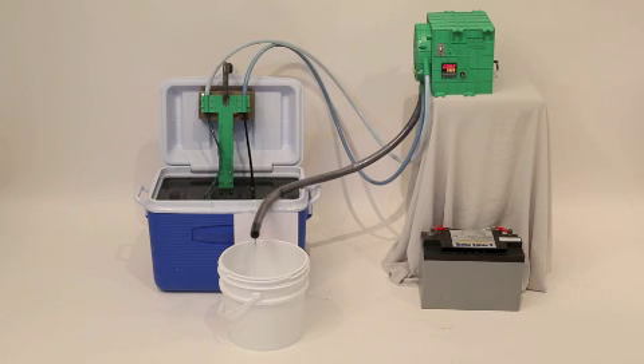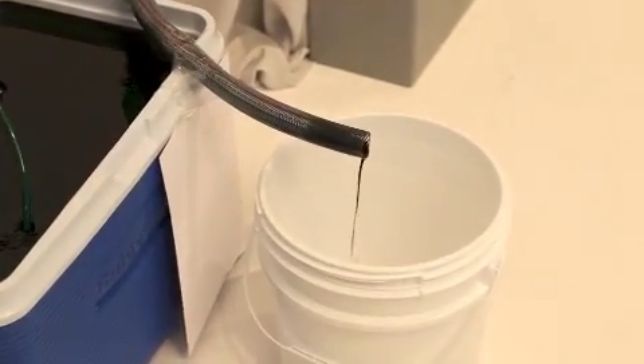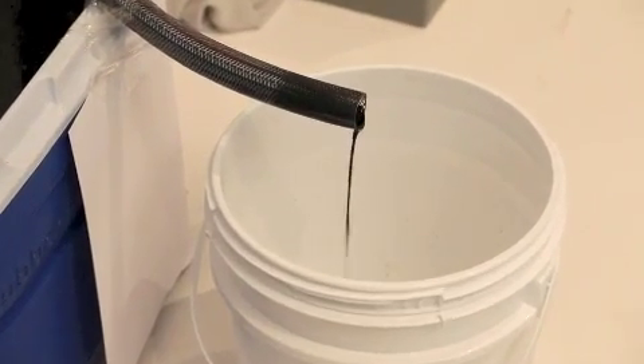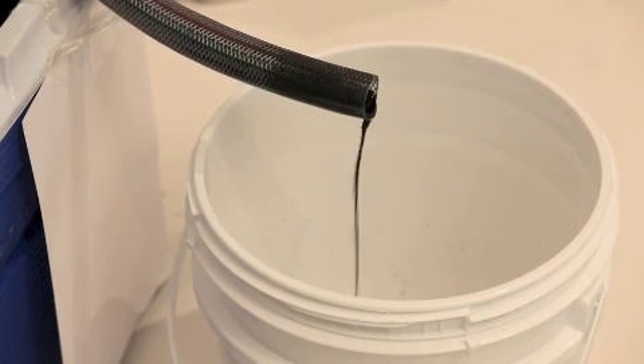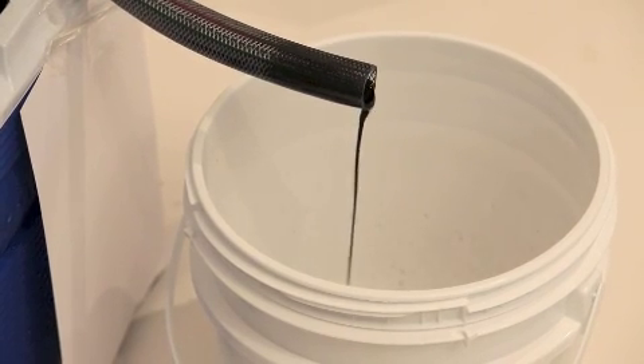On the left-hand side, that's the clean tube coming down. On the right-hand side, going up into the white tubes is the oil being sucked up off the top of the bath. As it goes up into the green unit on your right-hand side, it goes through a squeegee system that extracts it off into another pipe, and gravity feed brings it down into whatever container you want — whether it's a tank or a 20-litre pail — depending on the amount of oil going into your bilge.